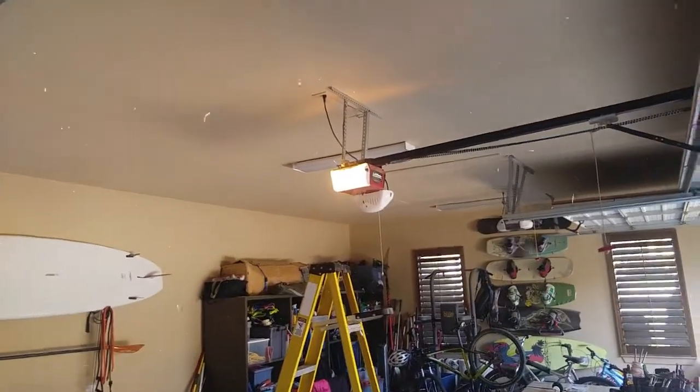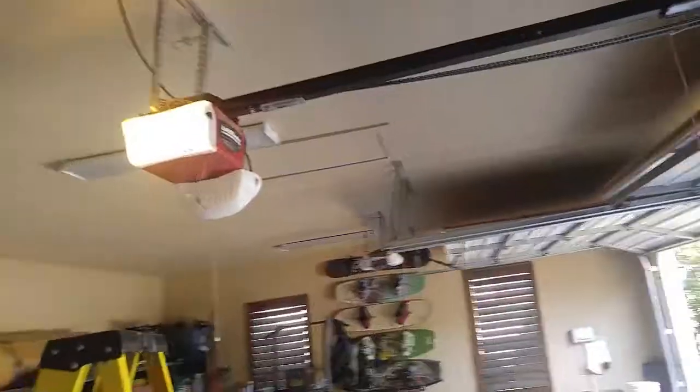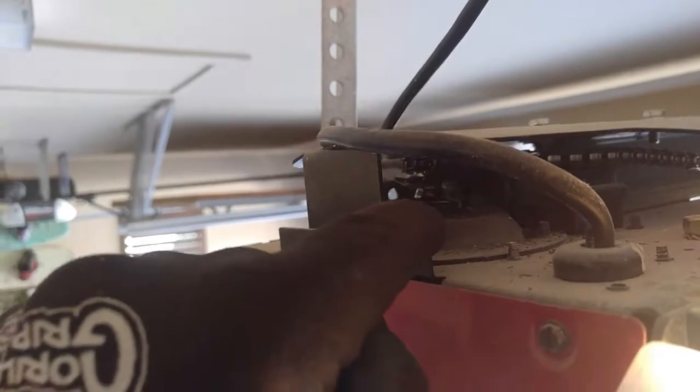Do some justice on a garage door opener. I press the button and nothing happens. If we climb up here, the chain isn't moving. Right inside there's a sprocket, and it's broken. Holy fruit salad. I need to do some justice, quick, and change out that sprocket.